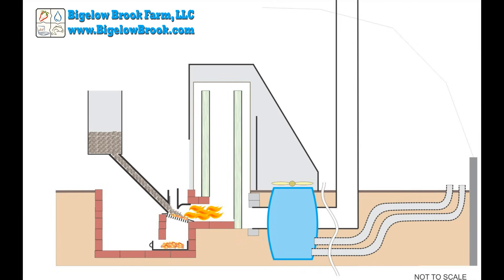Now it's time to make some major additions to the heater unit. I've made a metal shroud that covers the heater and barrel. It has an opening at one side to let in cool air, a baffle to force more air around the barrel, and then a fan to blow the warm air through the corrugated piping.